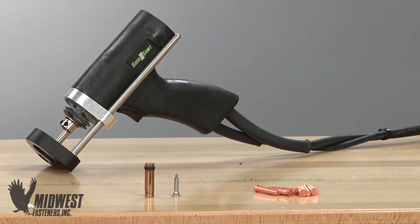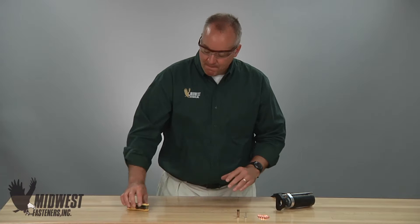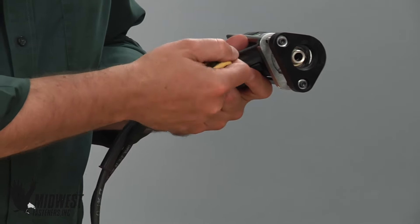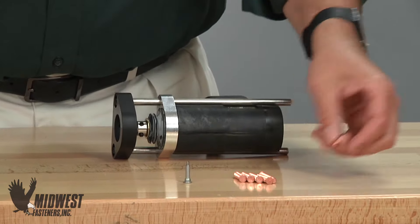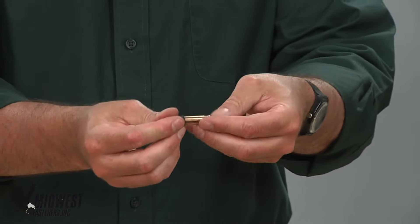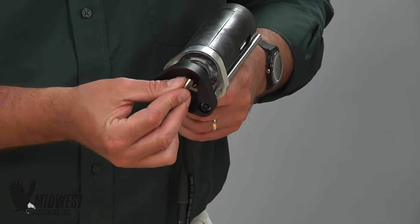First, a simple assembly called the B Collet and B Stop. To install these accessories as an assembly, prepare the CD gun by loosening the screws at the end of the gun shaft to accept the parts, and loosen the set screw on each gun leg. Before installing the collet, make sure the collet is the proper size for the stud diameter to be welded. Next, insert a proper length stop into the back of the collet. Proper sizing means the stud will protrude past the end of the collet but still be held tight and rigidly during welding. Never allow the head of the stud, or what is called the flange, to come in contact with the collet during welding action. Insert the collet and stop assembly into the gun until it seats and stops fully.